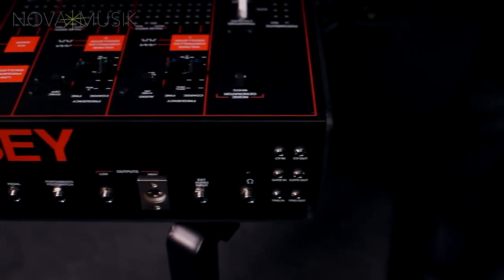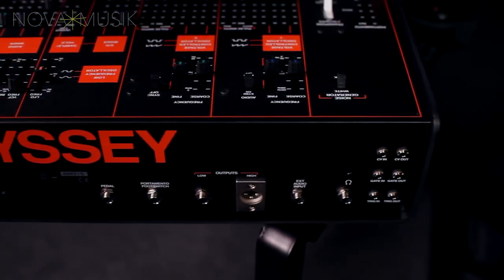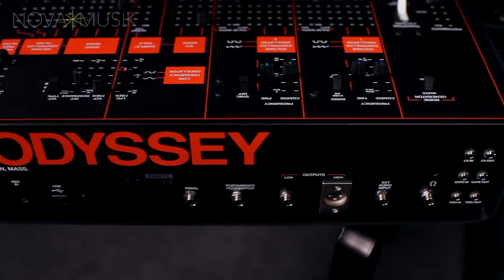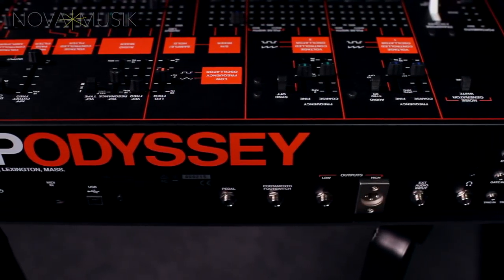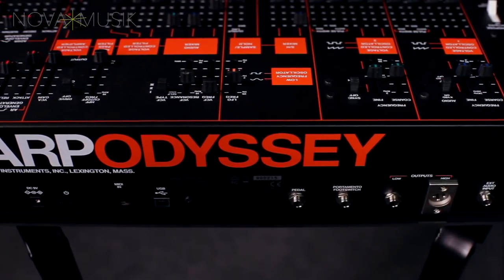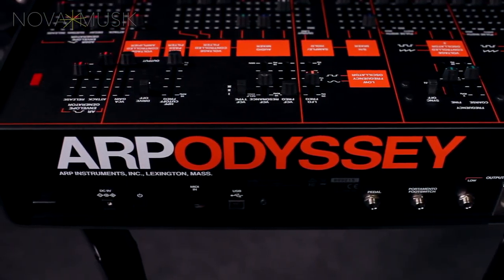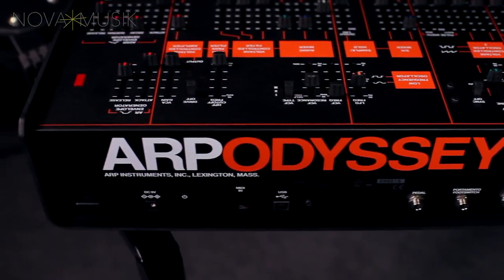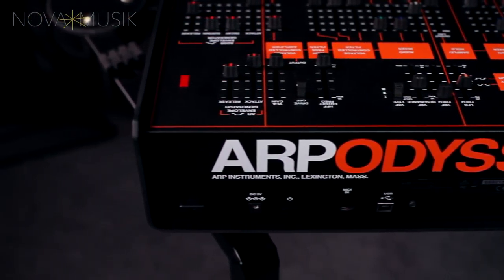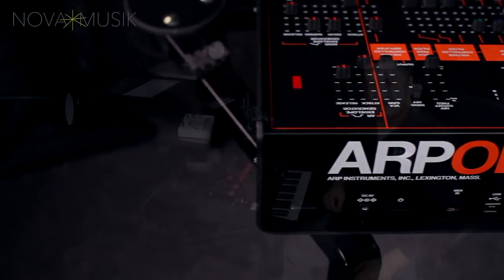On the back panel of the Odyssey, you'll see that we've gone mostly with the Mark III configuration, which gives you the most options for CV and gate in and out, along with the XLR and quarter inch outputs. We've also added a dedicated headphone output with its own volume control, and that wasn't on any of the original Odysseys, and it's incredibly helpful. Next, you'll see the things that we've put on there for the modern age, MIDI and USB. USB will allow you to do MIDI in and out from the key bed, and the MIDI in will allow you to control the Odyssey from another controller.